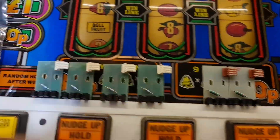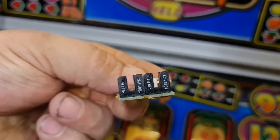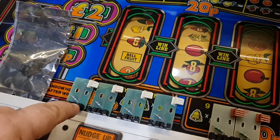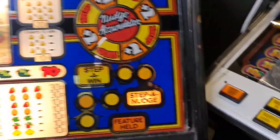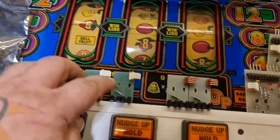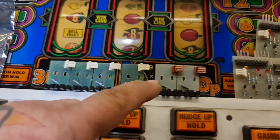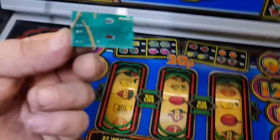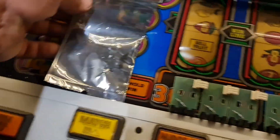When I change one of these out I've also got some of the gates. See the gates there - this is what we're on about with repairs. They're the little H-gates - basically what goes faulty. They create a field and the tab goes through it, and the machine knows the position of the reel. The one I swap out of reel three I'll keep separate, because I know these are all working. They've probably had new gates. I'll send it off to my mate because he's much better at those - look at the size of them, there's eight. He'll change the gates for me.